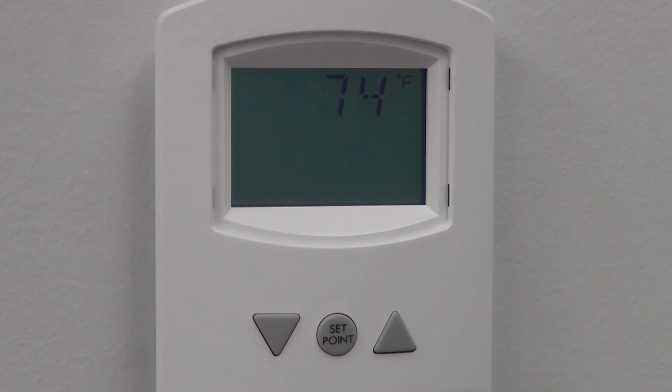After balancing is performed, the programming in the controller calculates the airflow correction factors and uses these to calibrate the raw reading from the airflow sensor. For dual duct controllers, the same procedure is followed for the secondary duct.